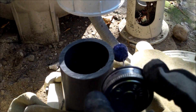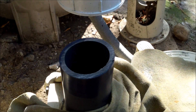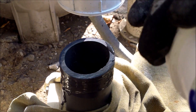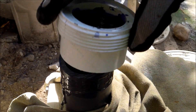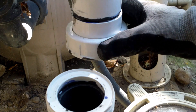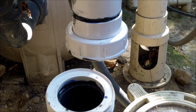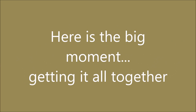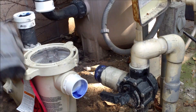I'm going to go ahead and glue it — put the primer on first. Then apply the glue, the cement. Put it down and push down, giving it a twist. This is the only way you're going to get this on here — with the union — because there's no way you're going to be able to jam the front pipe and this pipe in at the same time. I'll tape this out of the way so I can get a nice clean fit.